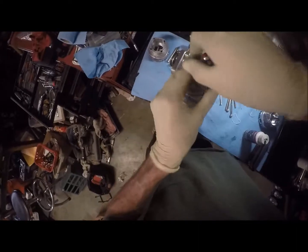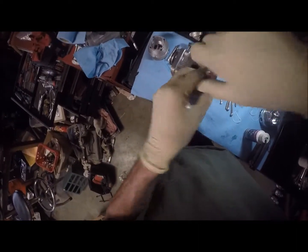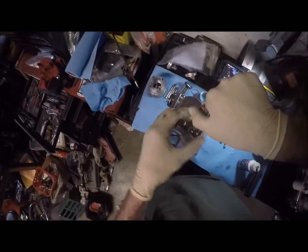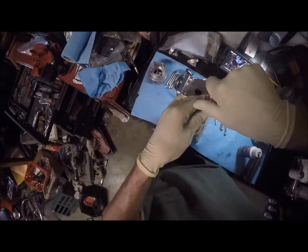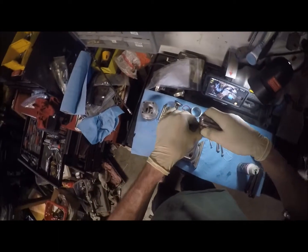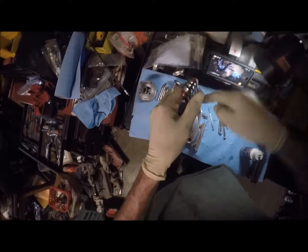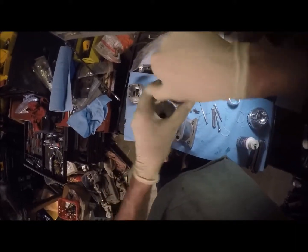These are Allens, so if you do crank them too much, they probably will strip the Allen socket out. One common thing with these type of bolts is torque. If you get too much, you can mess up the bolt real easily. A good quality Allen wrench is a big must too.